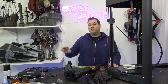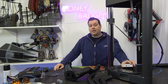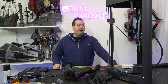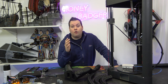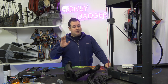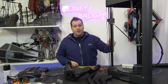Print quality is clearly improved. The linear rails weren't particularly expensive — they're two-trees stainless steel, not high-end rails. For Klipper, I had a Raspberry Pi laying around. Raspberry Pi prices at the moment are insane. If you can get a Pad 5 from BigTreeTech, the CM4 will run Klipper and Mainsail pretty much bang on. What's in here is a Pi 3B and it's doing a stellar job. We've lost a little bit on the bed perimeter and 50mm on the Z.